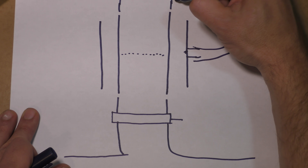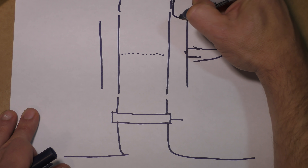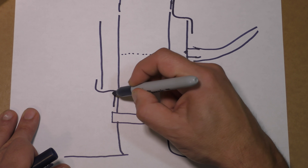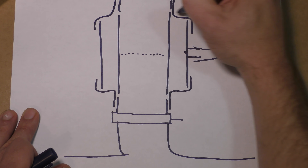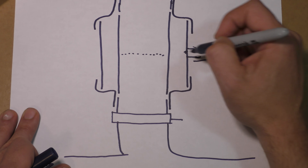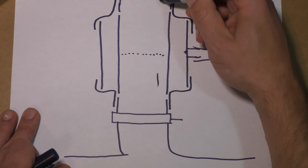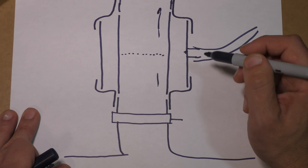To interconnect all this, I basically took a two-inch to three-inch rubber coupling and used it to connect everything together. There's a clamp at the bottom at this junction that holds those together, and then there's another clamp up here. So this is still a continuous pipe, but now I've created this chamber where we can pump air into it, and the air comes out through these little holes. The water can come right up past this, the air is added in, and there's no debris getting into the side area.